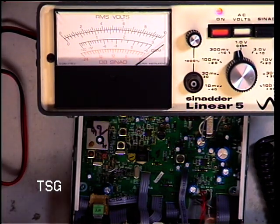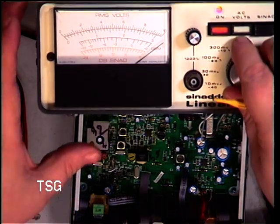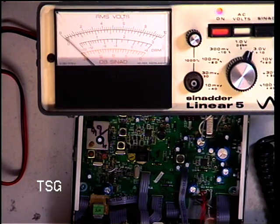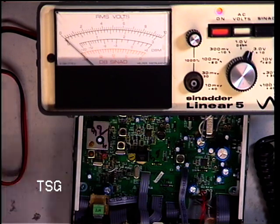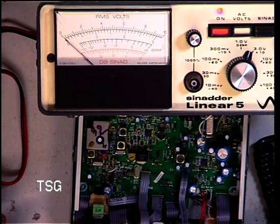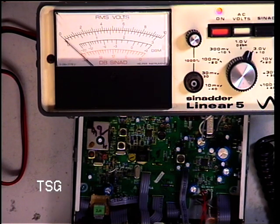So I'll be looking at the one on the test set. I've selected the AF voltmeter on the test set. What I'm trying to do is to maximise the audio level — so what the meter is going to be reading — on top of looking at an oscilloscope screen to make sure it isn't going all funny and that the sine wave remains what you'd expect. So, having said that, I'm going to adjust the oscilloscope now. I need a bit more volume for the oscilloscope.